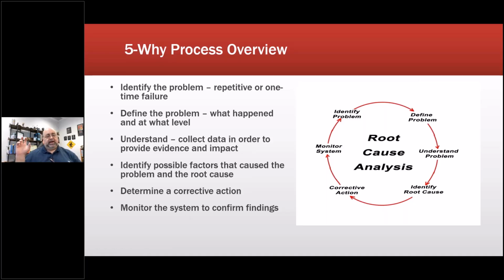At one plant, we had identified a failing 69 kV line from the utility. It was a dedicated line to the plant. We did the root cause. We figured out what was wrong. We had them switch over to another 69 kV line, which also serviced the local community. So all of a sudden they had power issues all over the place coming into the plant. The plant did not have corrective equipment in place, and they lost several drives.